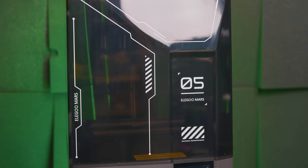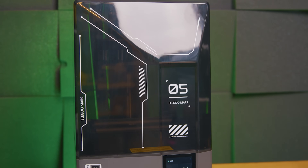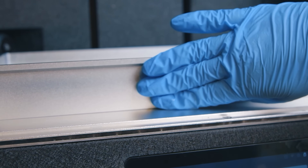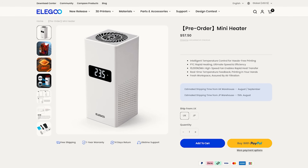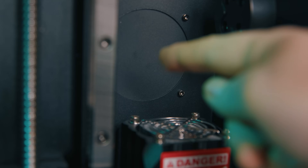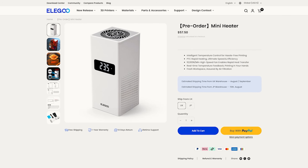Though this does lack an integrated heater, which is something I and many other users would much prefer to be properly included and integrated into all modern printers — or at least have a proper, solid, workable option as an optional extra. I've got limited faith in the mini-chamber heater they have upcoming, because like the inbuilt heater in their Revo printer, it blows heat into the top of the case, which is the last place you want heat when you're trying to heat resin. I'll let you know more on that when I get one.